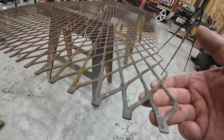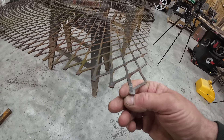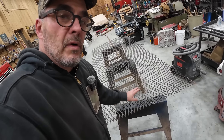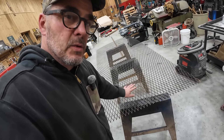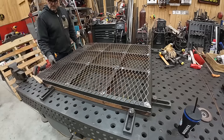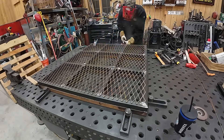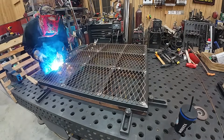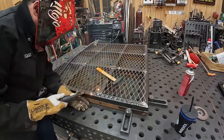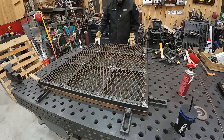This is expanded metal wire mesh — I got this on Facebook Marketplace for $25 a sheet; the guy had two sheets. I'm going to cut this with the angle grinder, and this is going to become the deck of the ramp, the underside of the ramp, and the deck of the actual cart. This expanded metal isn't probably the best choice for this deck, but it's what I have and I can change it out later or put planks on it to increase the strength. But it's important to weld every single open edge so it doesn't become a problem later.